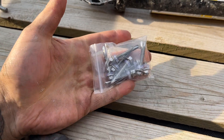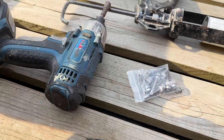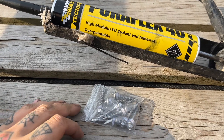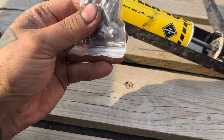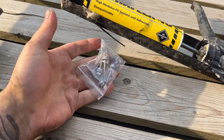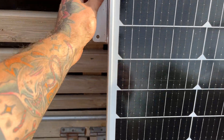Just a quick little side note. These are like self-drilling screws - you'd call them tech screws. You use this attached bit on a drill driver. I'm also using some of this PuraFlex 40, which is a flexible sealant and adhesive. I'm just going to put a little blob of that on just to make sure these don't leak. They have got washers, but I'll just make double sure nothing leaks. I'll put a little blob on each one - they just attach with these brackets.